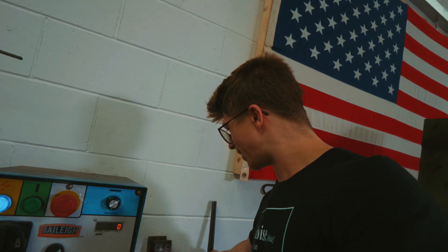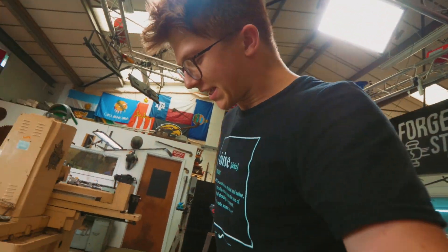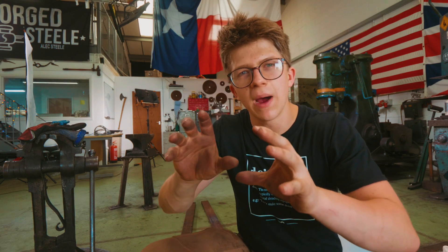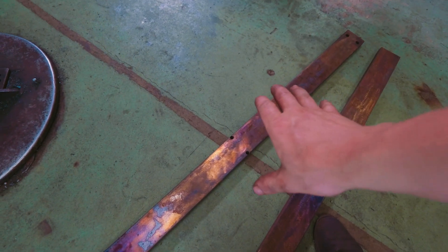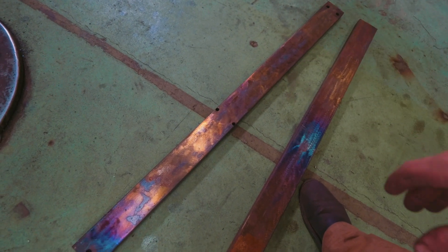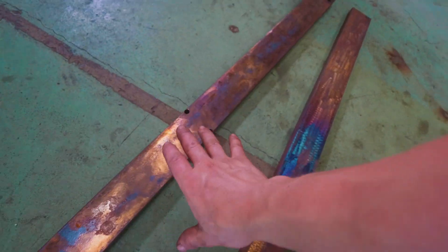What is a temper? Having hardened it, as we noticed, it got extremely brittle — obviously — because it then cracked. What we want to do, ideally before it cracks, at a lower temperature in a very controlled manner: we're going to slowly bring the temperature up so that the structure at the edge is a little bit more supple and tougher and able to withstand the abuses of a sword, because it's too brittle. That is what these steel clamping pieces are for. We're going to clamp the blade between them — these are going to act as a heat sink, taking out as many irregularities in the heating as possible.